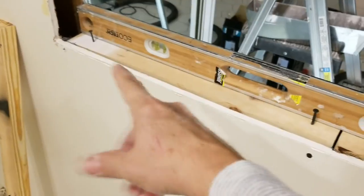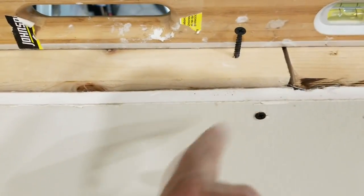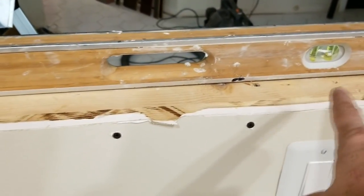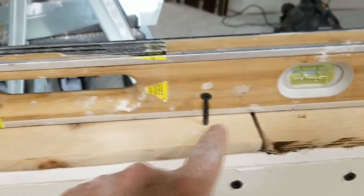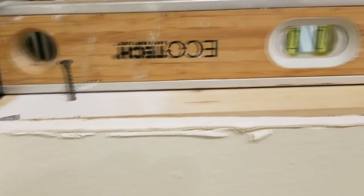As we're placing our plates across the top here, there's a metal stud right in the middle, so we're doing it as two pieces and screwing in from the side through the metal stud. Make sure it's level side to side. The first piece went in level, and then I put a screw in on either end of the second piece. Pull it up with your hand or pliers until it's flush with the first piece using the spirit level. Come to the other end and make sure it's pulled up level - you shouldn't see any air gaps underneath the spirit level.